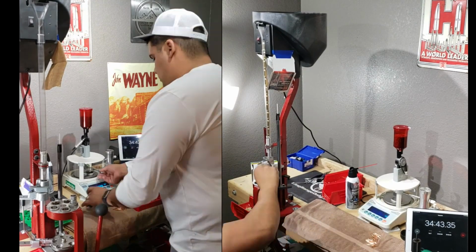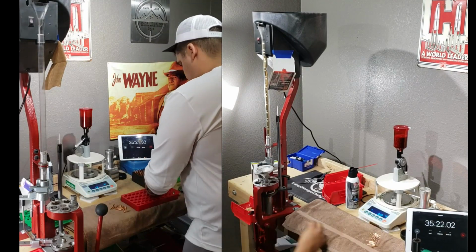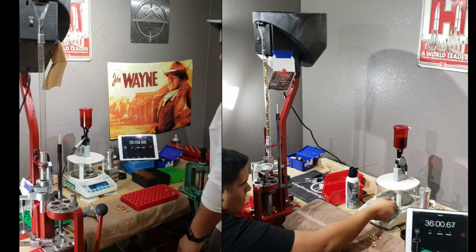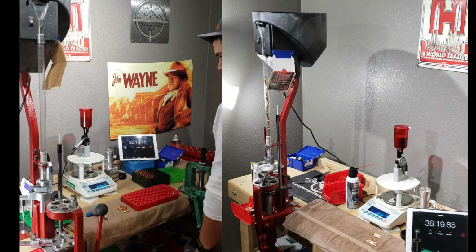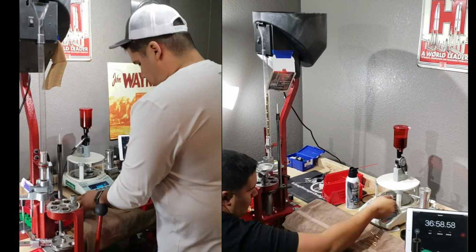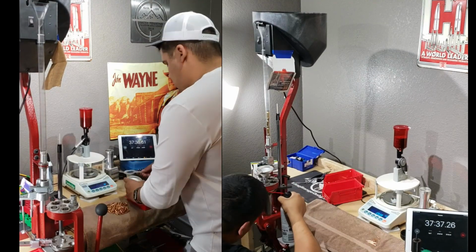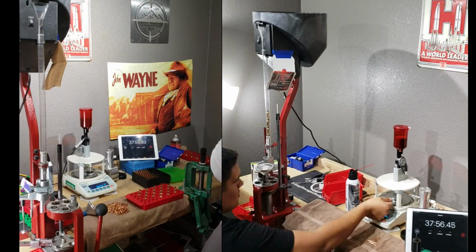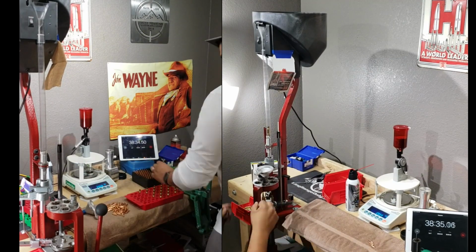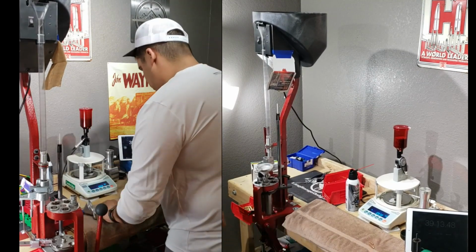But then what I do is basically, while it is finely trickling the last little bit, I'll put a bullet inside of a charged brass, pull the seated cartridge out of the press, put the newly charged shell in the press and run it to the top with as smooth and as little shaking as possible, and the process starts all over again. So one thing I think you'll notice, similar to the sizing of brass, is I'm doing much less physical work on the right.